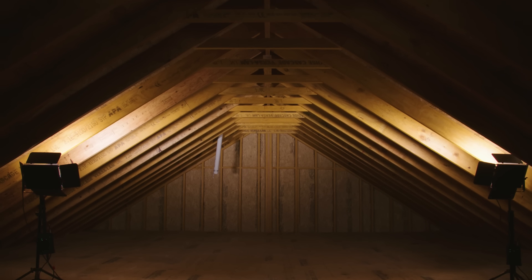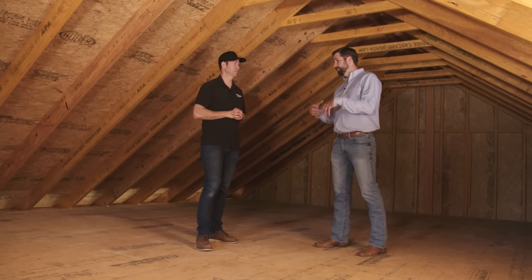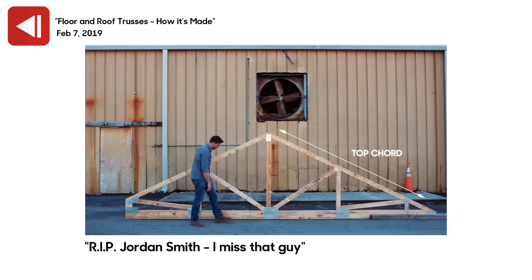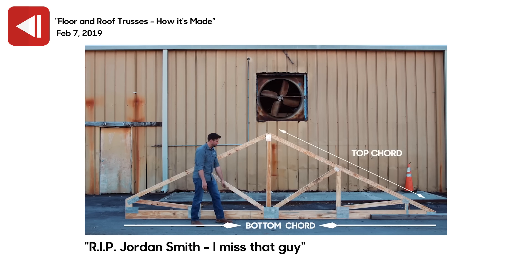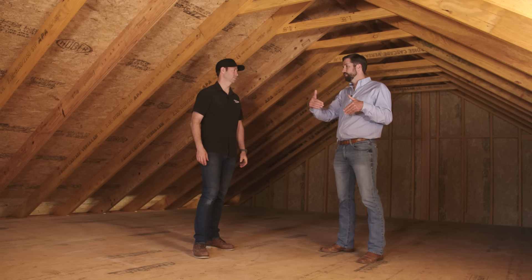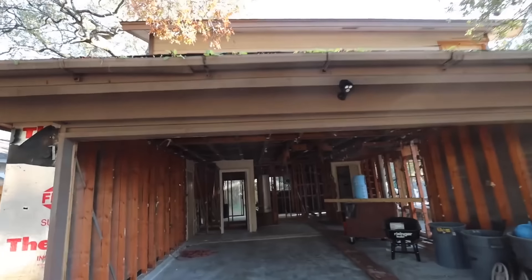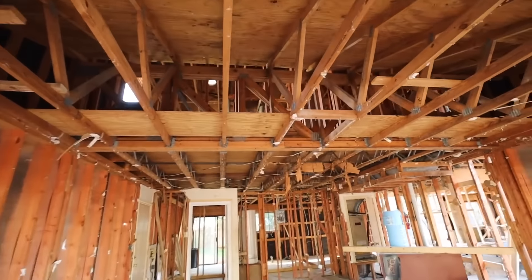What's typical for attics and roof framing in America these days? Well, what we see most often are roof trusses, because they're efficient and cost-effective. Another very common method is to use interior load-bearing walls and brace rafters - using a smaller size rafter braced down to interior walls with two-by-four bracing, often called a strong back.